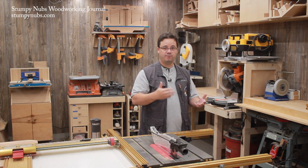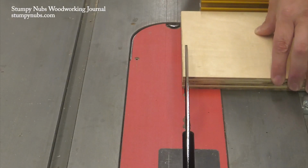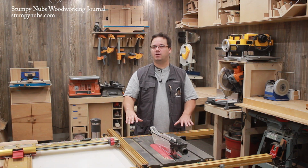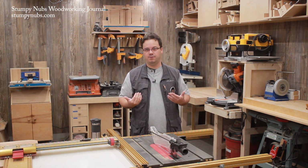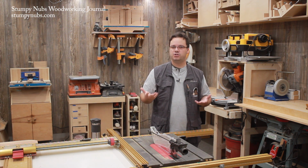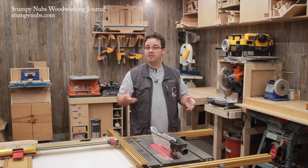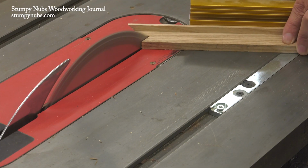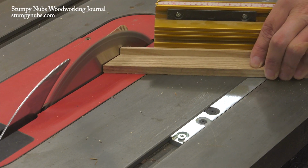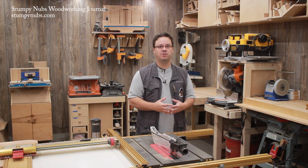And if you reversed everything by mounting that same blade in the table saw with the workpiece now on top, that same negative hook angle would lift the workpiece upward and potentially kick it back at you. You see this argument occasionally on message boards, usually in theoretical discussions by well-meaning folks who have never actually experienced a kickback from a negative hook blade on a table saw. It just seems to make sense in theory, so they'll debate it all day long if you disagree.